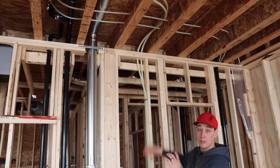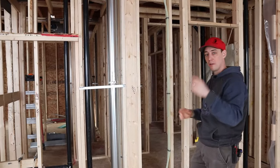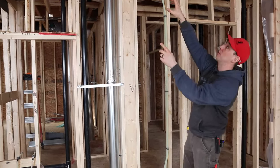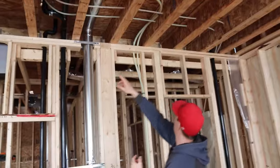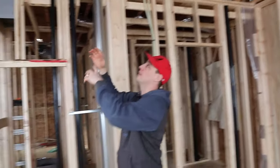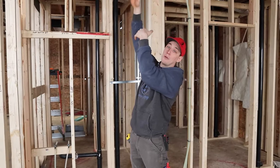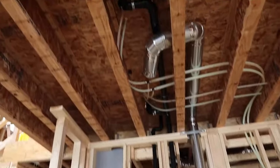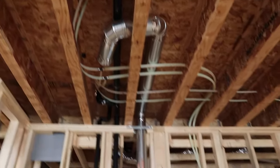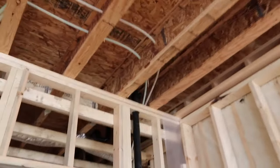So I drill all my holes — it's the same as with my drainage: I always like to drill my holes first, plan everything out, drill all my holes, and then I just start throwing pipes. I'll throw my three-quarter in, stub it down into the basement — hot and cold — and then I'll run my half-inches first and then I start doing my tie-ins. Once my pipes are all kind of dangling next to each other, I come out and start doing my three-quarter by half tees, picking up the two sinks and the two hot and colds for the RTF that we talked about upstairs. They run from here over to that sink and they're just kind of dangling over by the tub. Somebody else is coming in after to do the tub — it wasn't ready for us when we were here.